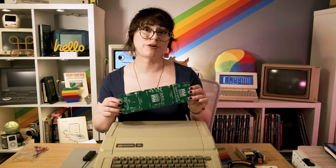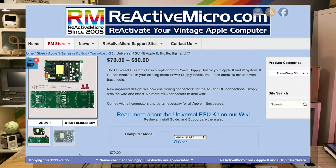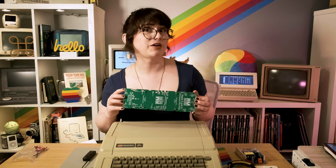Welcome to Macintosh Librarian Labs. Today we're going to be talking about my power supply in my Apple IIe. Recently a RIFA cap exploded in it and smoke came out. Luckily this didn't hurt the computer, but this power supply is pretty old and a lot of the components probably are tired and worn. So I think it's time to replace it with a Reactive Micro replacement power supply kit. I'll be going over this and talking about the pros and cons of replacing the guts of your power supply versus just replacing the bad capacitor or the RIFA capacitor.